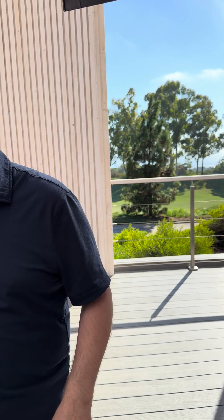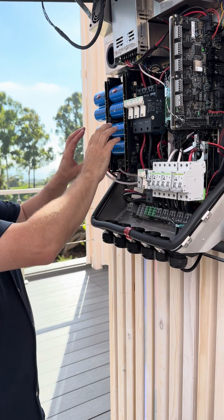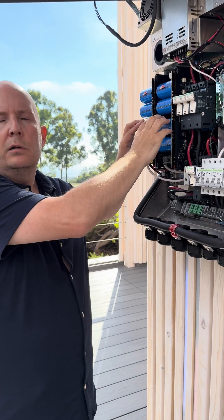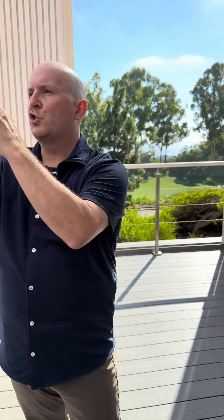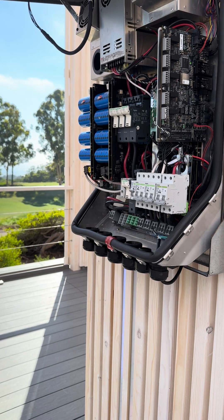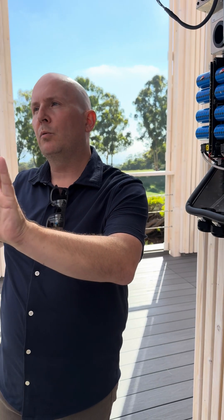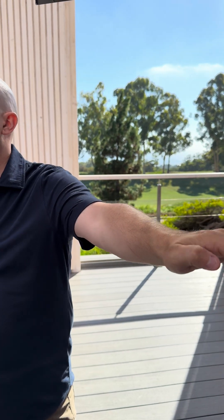Second example: a car just arrived home and I need to go 16 kilowatts on this unit right now. I'm going to use the grid because I need more power. I want to bypass 11.5 kilowatts into it using the DC bus. Maestro tells the bus matrix to take the two AC/DC cores and merge them into one big single core, then go DC straight into the car. So in parallel, I've got my solar going to the battery and I can still charge on the other side.